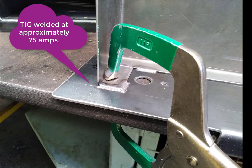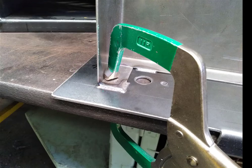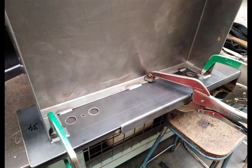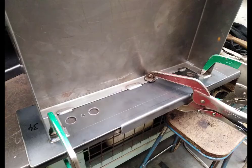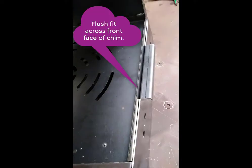I've used 1.2mm stainless steel TIG wire — not a very big wire. You don't want a big weld; the less material in it, the less distortion. Clamp it down nice and tight, use two or three clamps or even more if you have to, but do it on the steel table to keep it flat. Put it back in, and if it's not sitting true across that front face, talk to the tutors — we can level it for you.